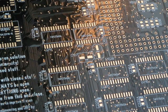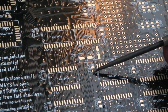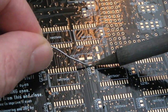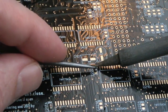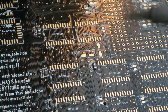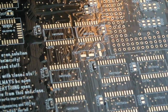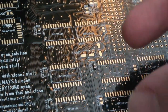So I've done the first few — it didn't take me very long. All I'm doing is my usual lazy approach. If you use tweezers and do it under magnification, you can do this sort of thing really easily. I'm just going to heat the pad and the cap — 330 nanofarad. It's tombstoned there so I'm just putting it flat. Then when I've done a block of them, I'll use hot air at 420 degrees with a bit of flux. It reaches temperature and pulls itself nicely aligned.